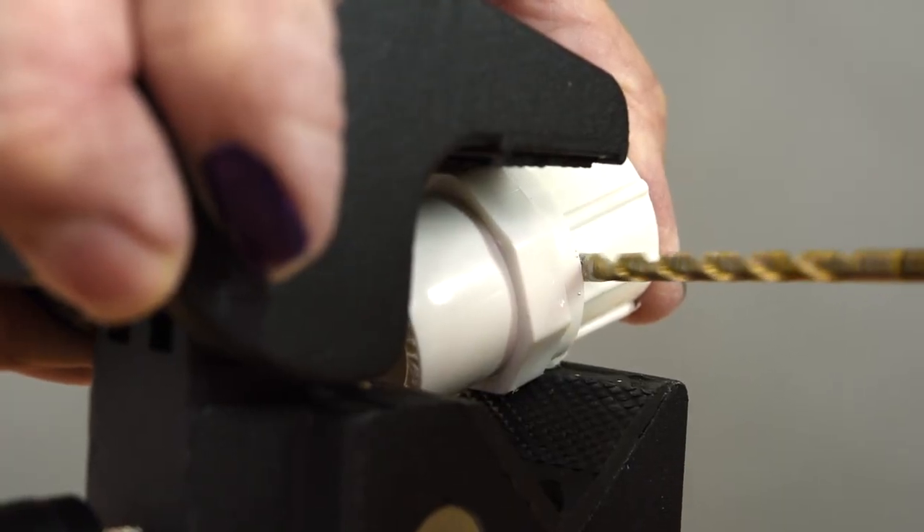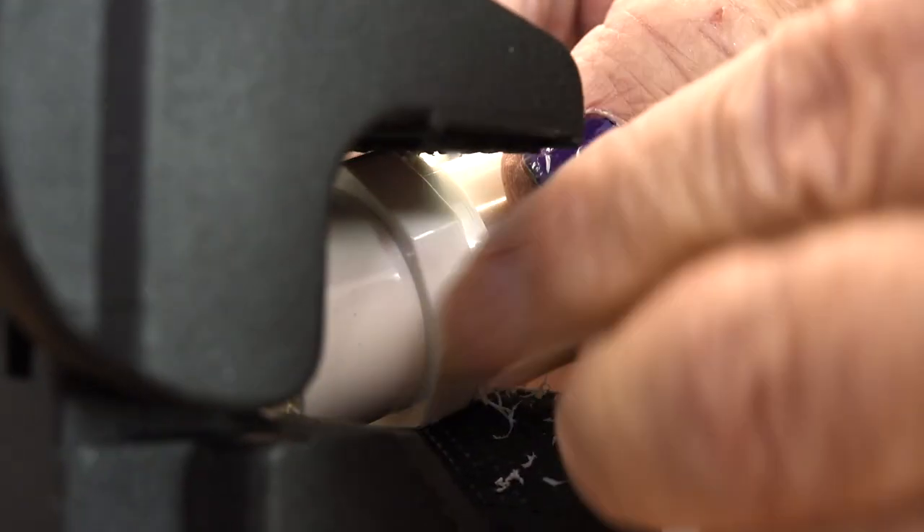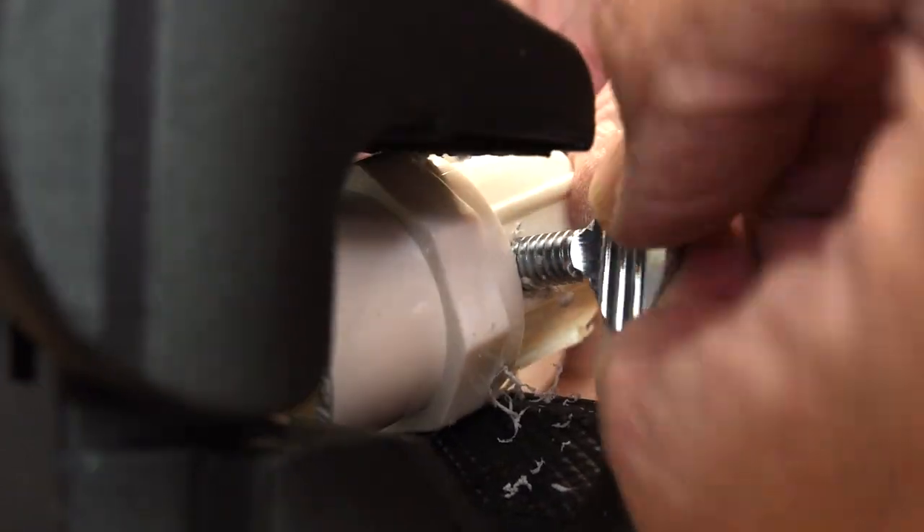After your cement has dried, drill a hole slightly smaller than the quarter-20 thread in the female adapter and then twist the thumb screw or knob all the way in. The first time you do it, it is going to require some extra effort because you are creating the threads in the PVC as you turn it. I used a pair of pliers to get leverage.